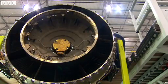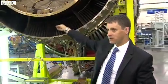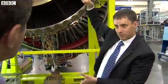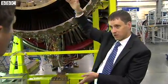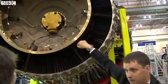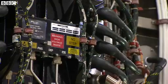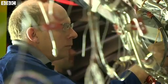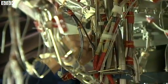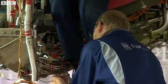This is where the air comes out of the core of the engine. You can see the last stage here of the low pressure turbine blades. All of the air that's come through here has been expanded through those turbine blades — they try to extract as much power out of the air as possible. Then there's a shaft that runs through the middle of the engine back to the fan at the front of the engine.